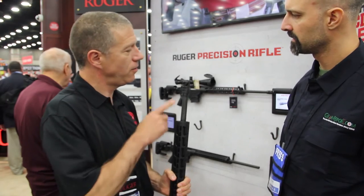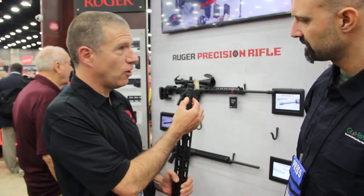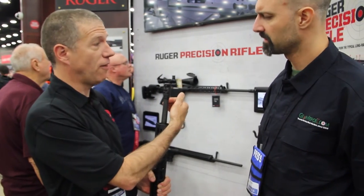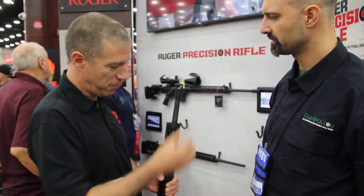Then on that muzzle end, we put in our own muzzle brake. This muzzle brake goes on with a jam nut, so you don't have to work hard to time it with shims. You thread this in, then the muzzle brake comes off. When you put it on, you put it on until you get it just where you want it, and then tighten up the jam nut. Pretty simple.